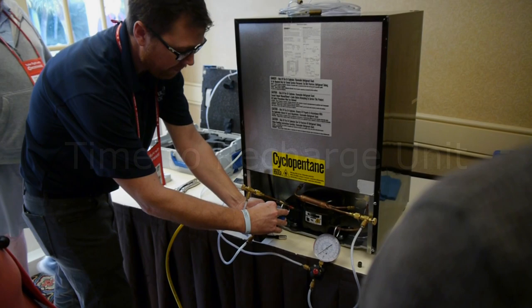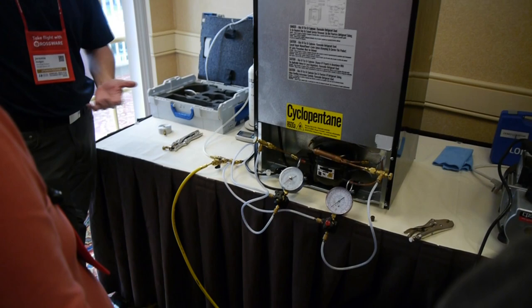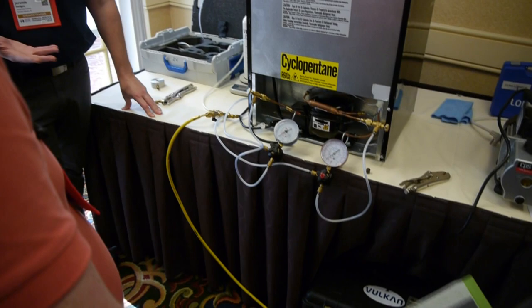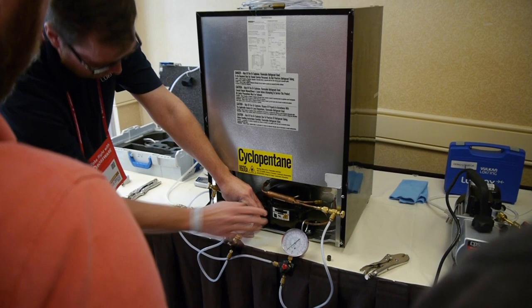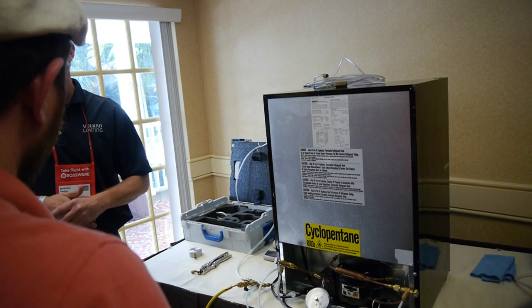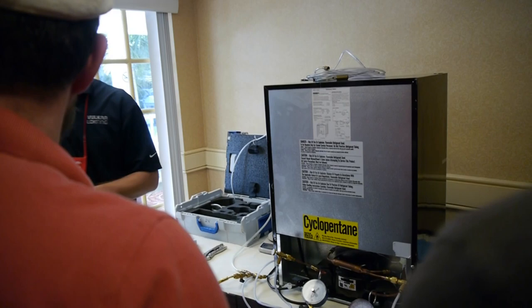I've already pulled down to my ultimate vacuum, which is down to 30 microns — obviously that's what our pump pulls down to. At this point, all I've got to do is wait about five minutes. To test all my connections, I shut the vacuum off from the system and wait — this is a standing micron test or standing vacuum test. I can do a full range of adjustment; if you're doing a pressure test on these gauges, be cautious because they only go to 45 psi. For pressure testing, you may only want to hook the high-side gauge up or you will blow those gauges.